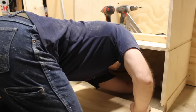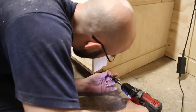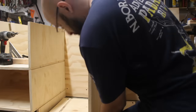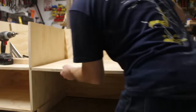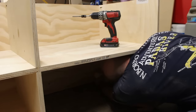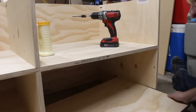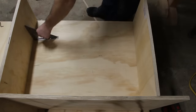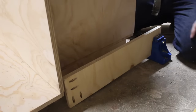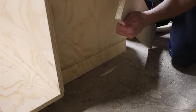For the bottom shelves on each side, I simply put glue into the dados, inserted the shelf, and then on the inside center divider, I put screws through the opposite side's dado to secure it in place. Once this side was finished, I completed the other side of the table with the shelves the exact same way, ensuring that each wall support was square to its respective shelves. The two front cove shelves got six pocket screws each since they only have one side support that they can be glued into. The toe kick underneath will help keep it from falling out.